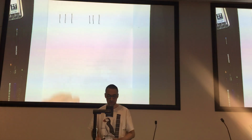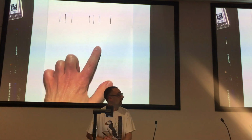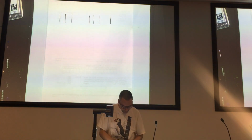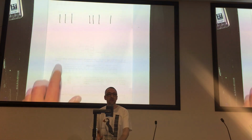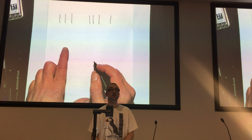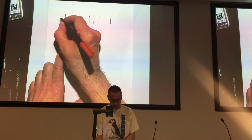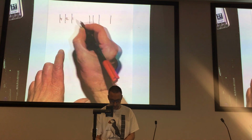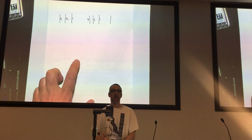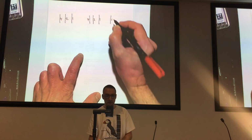And I'm actually going to throw in another bit, which is called the carry in. Right. So if these are 3-bit numbers, what are the place values of the individual signals? Yes. From left to right, they're 4, 2, and 1. And then this one will be 4, 2, and 1. And if there's a carry coming in on the right-hand side, it'll have a place value 1.